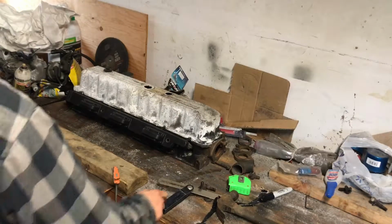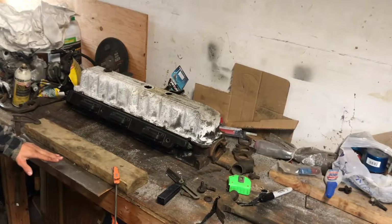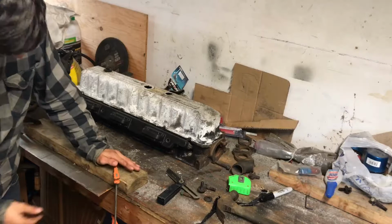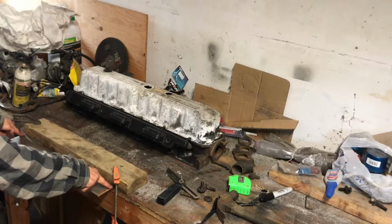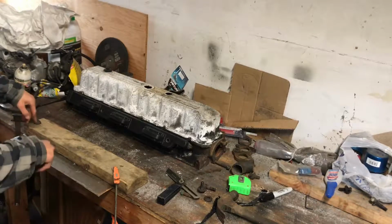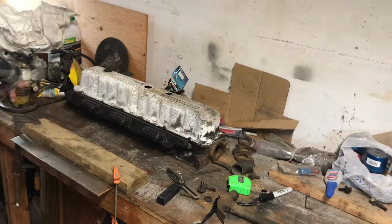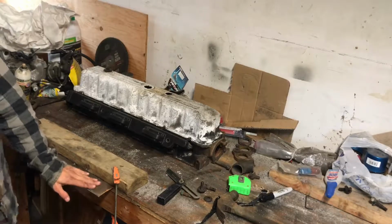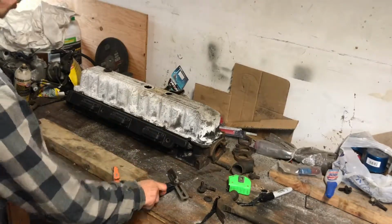Okay, so this is what I did. I put the metal on here on the bench, then lined up my dots onto the sides of the bench, and put a piece of 2x4 here, and 2 clamps to hold it down, and a hammer, and start banging away till we get to that angle. Pretty simple.